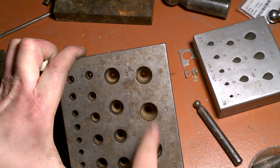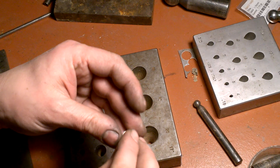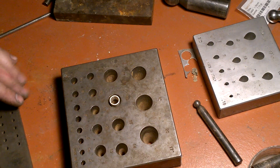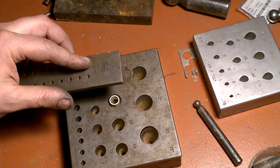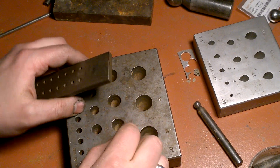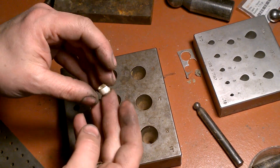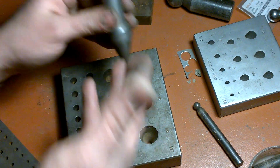The block has holes with different sizes but with a very slight angle. When you have the right size, you put the bezel on a hole and when the bezel is a little loose it will go inside the block. I use this — 'filière' in French, I don't know the word in English — to reduce the opposite end of the bezel.